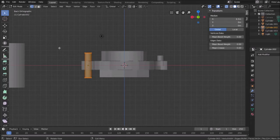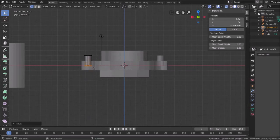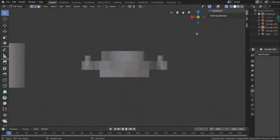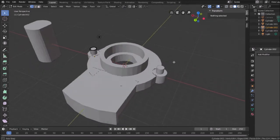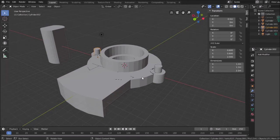So go into edit vertices, grab all these, and then by the numbers, set it to 2. Bring them down, deselect them all, grab the bottom ones, and then grab in the Z direction to shove them up inside. No particular position, as long as it's inside the volume, the Boolean operation will put them together. And I'm going to turn off x-ray mode, and get out of that mode.